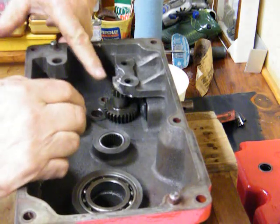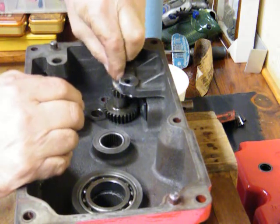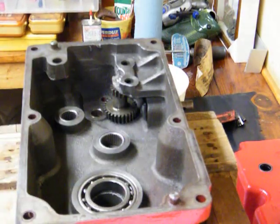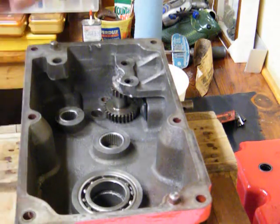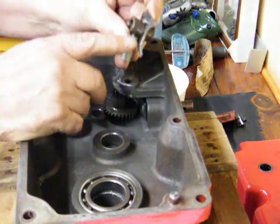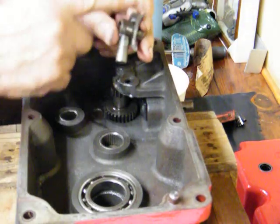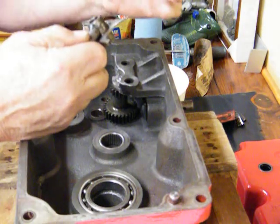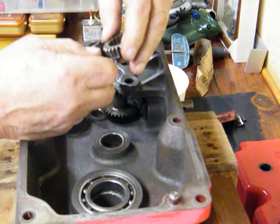When I was taking this thing apart I broke this piece off here, and my brother had it re-welded, so we're hoping it's all right. Then we take the fork assembly — this is where the fun is going to start. This is the piece that, when you can't shift from high range into low range or low range into high range, is usually bent or broken. There's a fork gear that sits on this, and that's what's really messing you up when it happens.